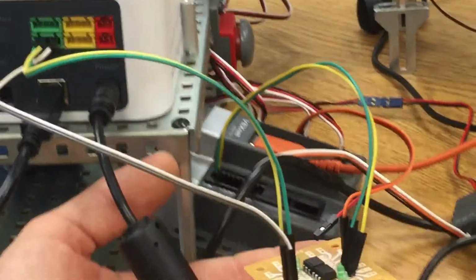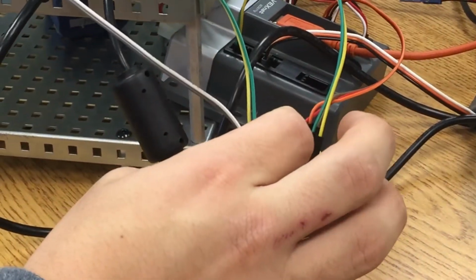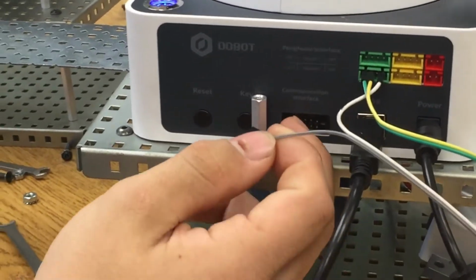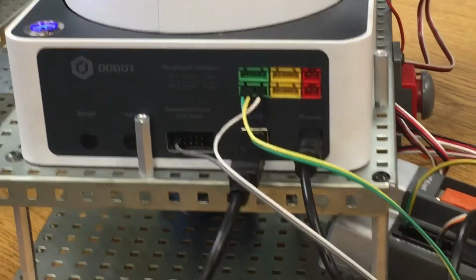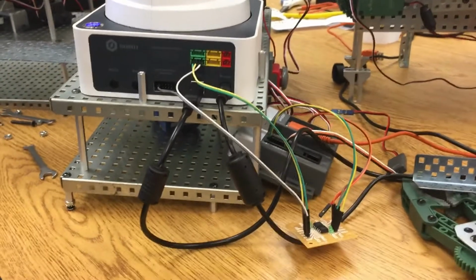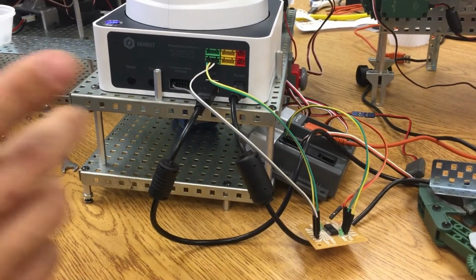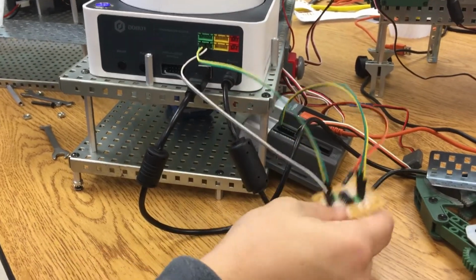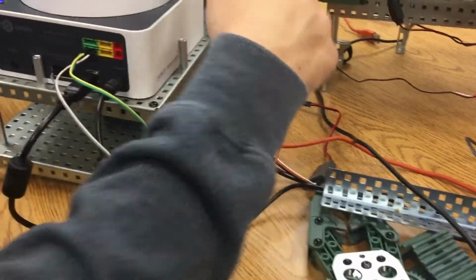And you see, I just plugged it in. It's happy. So you're running the VEX with that too? Yes. And then that goes through this board. It's just a relay. It just connects these 2 pins together. So this pin is EIO15, and this is your 5-volt down here. Your far left upper one plugs in there, and this one goes to the far right one of that port. So how come you don't need that pin in the middle? I think that was another output that I didn't need. And then it goes into there, runs through the code, it tells it if it's high or not. And then it comes back out through these wires, which is just power and ground. So when it turns on, it flashes your light, it closes your relay, that runs it back to the VEX on what you call a touch button. Okay.